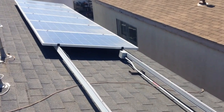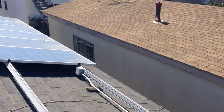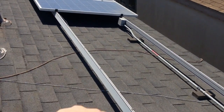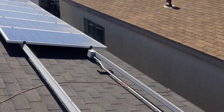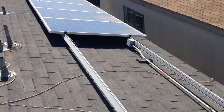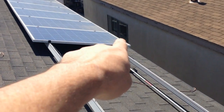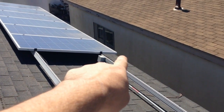I just answered my question when I came up here. That junction box has an additional knockout. So all I'm going to need to do is fasten my inverters onto the rail, then fasten the added panels, plug them into the inverters that are on the rail. And then the branch cable's got your four 240-volt AC wires — your two hots, your green, and your neutral. All I'm going to do is wire nut them to my existing through that knockout.